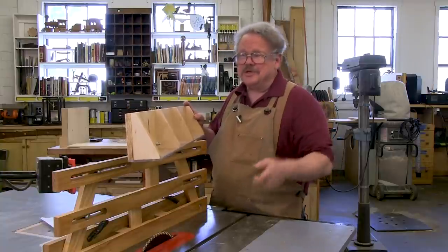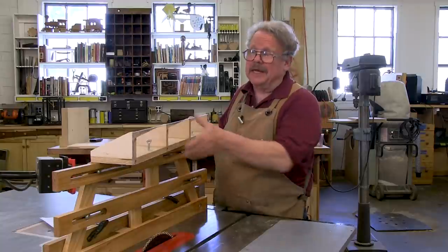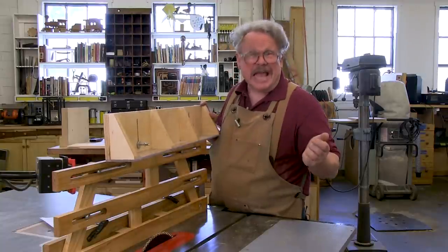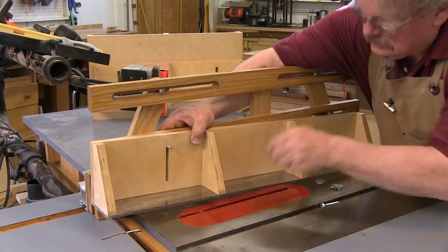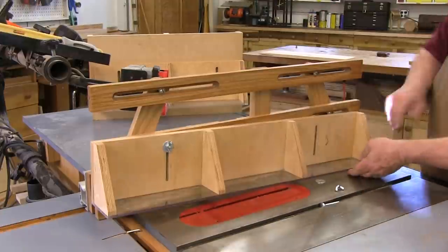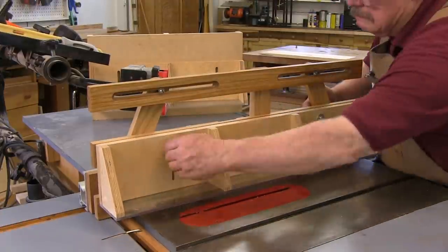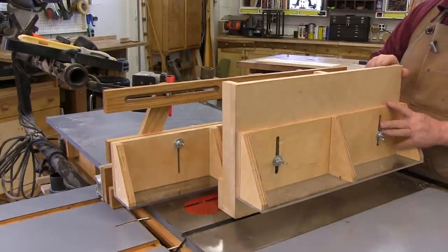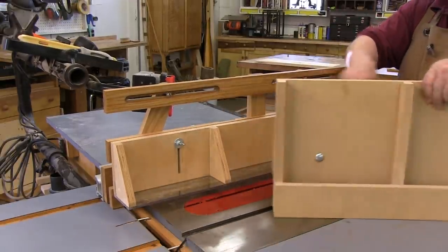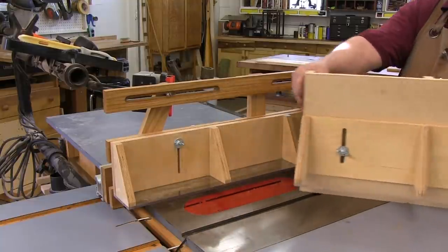When you do this, you can no longer use the fence surface to guide the wood past the blade. Instead, you use the fence edge. You attach the horizontal fence to the tall fence — here I am attaching it to the adjustable fence, and here it is attached to the simple fence. Incidentally, we provide the drawings for both fences — the simple fence and the cool fence — in the plans that we offer at the end of this video.